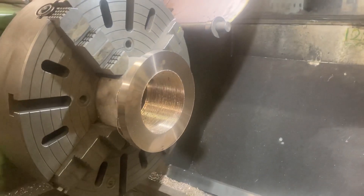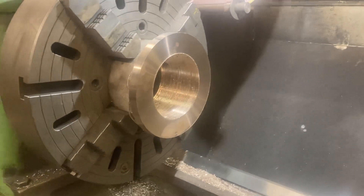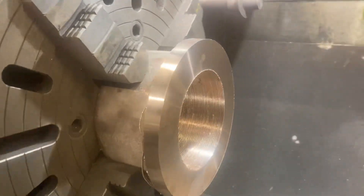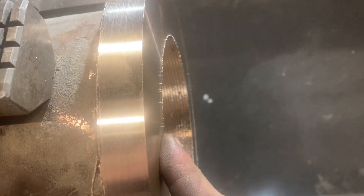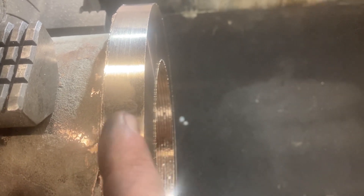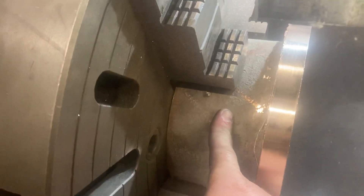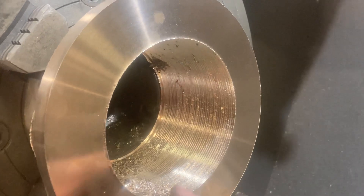I put a quarter of an inch on the outside diameter and a quarter of an inch on the thickness of the flange. The foundry usually put a specified quarter of an inch on the body too — it often ends up slightly longer, and I've found that when they make them with a longer body we have far less problems with air bubbles in them. So we start with the raw casting. We then start machining it — this one here is about halfway through. I have faced off the end to clean it up, which gives me a datum surface for calculating the length of the bush. I've also taken the outside diameter of the top hat and turned that to finish size — that's my datum surface.